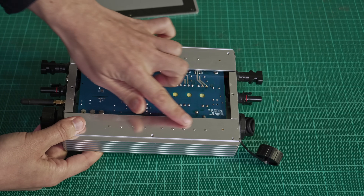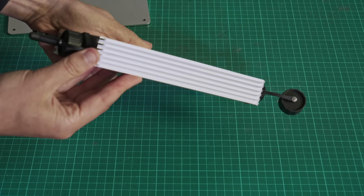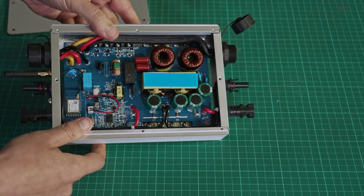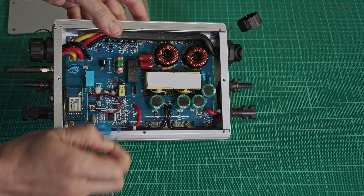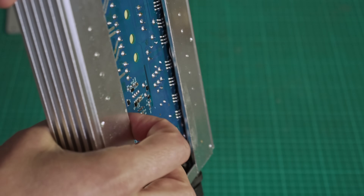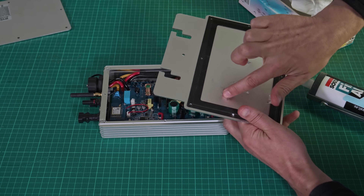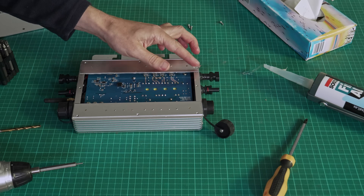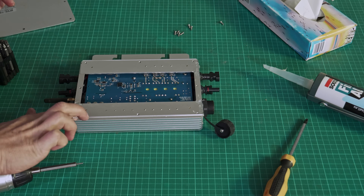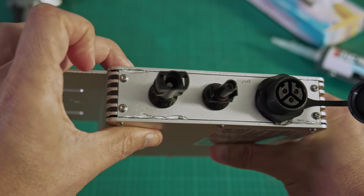I need to fix that. Design-wise all the transistors are tied to the heavy aluminium side, but with the gasket in place there's only a little thermal connection to the covers. It also would help if the thermal adhesive pad on the transformer didn't still have its protective film on. The thermal pads on the transistors look okay though. I added some silicone caulking to the corners and a bit extra around the LED. The unit goes back on the roof tucked underneath one of the panels to be protected from direct rainfall.